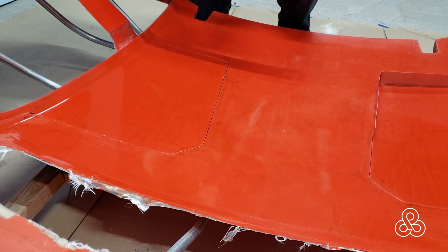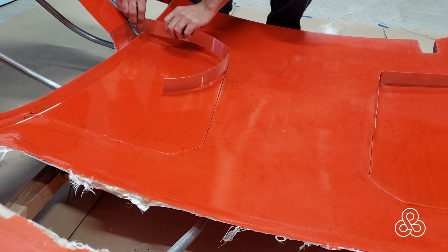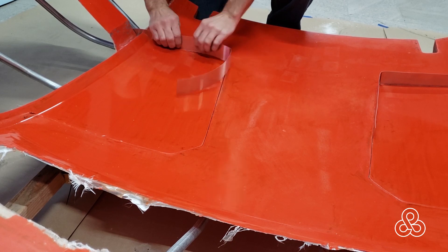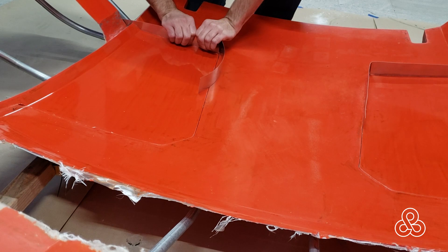This flashing is just made out of like a 24 to 26 gauge really light aluminum flashing, something you pick up at Home Depot. It's usually a flashing used for weatherproofing, but that is just barely enough gap that you have to squeeze it in there — sometimes you have to flex the mold a little bit to get it to fit in.